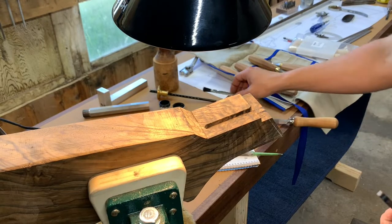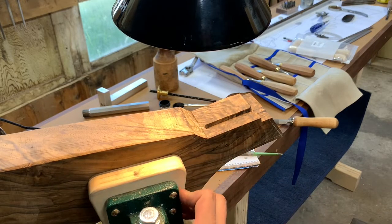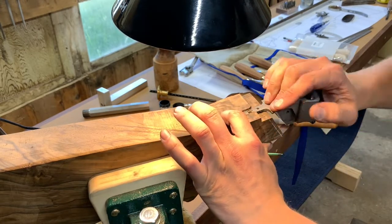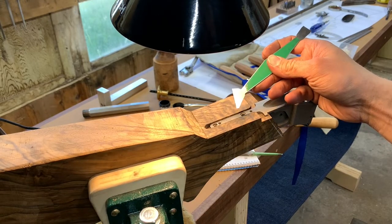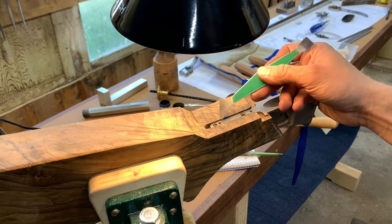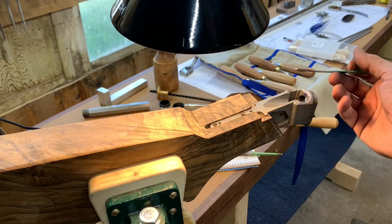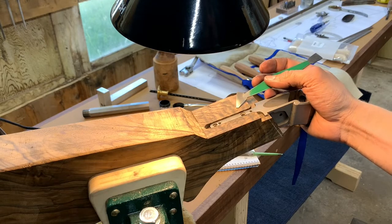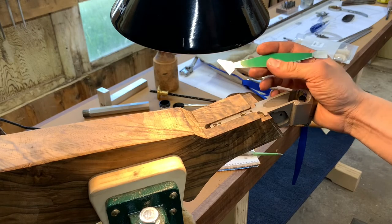The main tools I'm using here: first off, this carver's vise that I got is incredible — the jaws move, I'll do a separate video on that in the future. Other than that, I'm using the Jerry Fisher scraper, which is available at Brownells. These are great tools — it's advertised as an octagon barrel tool, but I honestly don't use it on octagon barrels at all. I use it mainly for doing receiver tangs and the faces of receivers. This is definitely the most used tool for me when inletting, along with my one chisel. I'll put a link in the description for these.